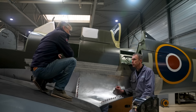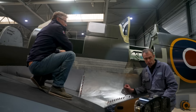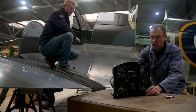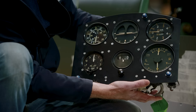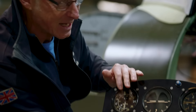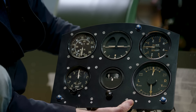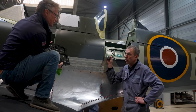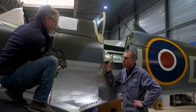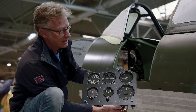Once that's done and tested, it won't take that long to fit the controls — all the control cables are ready to go, and that will be done towards the end of the build. The instrument panel is ready to go in as well. Both blind flying panels are done, but again they won't go in till right at the end. These were essentially interchangeable amongst aircraft — the blind flying instrument panel, as they called it back in the day, was a brilliant design. That could be put into a Mosquito, and you'd always know the airspeed indicator was top left — such a clever way of having similar instruments in all aircraft, right through from basic trainers up to Lancasters.